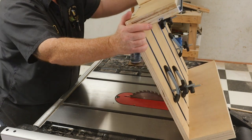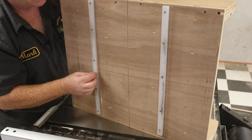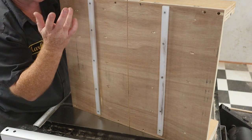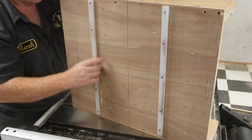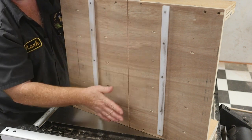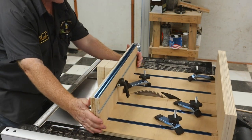Let me lift this out and show you these little strips. See these little guys — they're made out of some weird plastic, and if you put the screws in slightly too tight they expand out and you can't get the thing to slide. When I drilled and countersunk them, they expanded out and I had to do a significant amount of sanding just to get it to slide. I have Minwax paste wax coming that I'll use on the whole underside — that'll make it slide significantly easier.